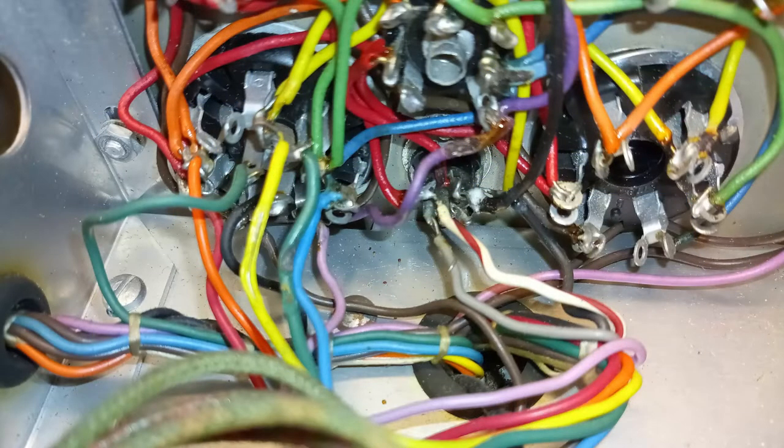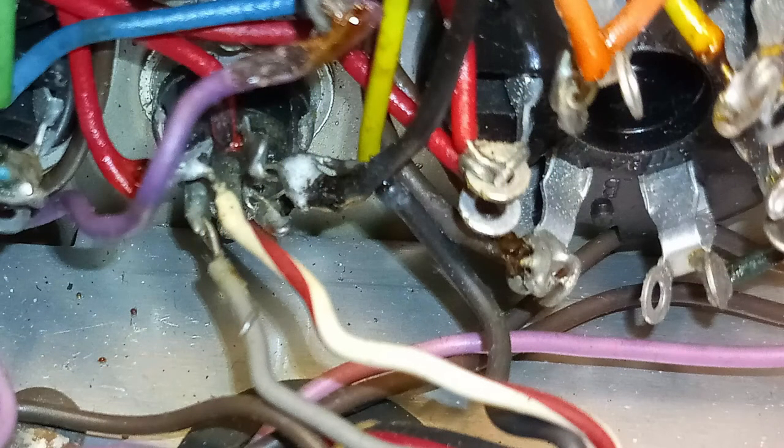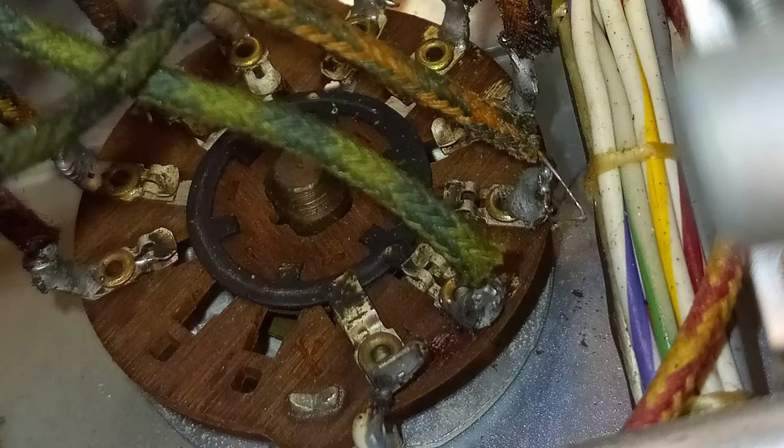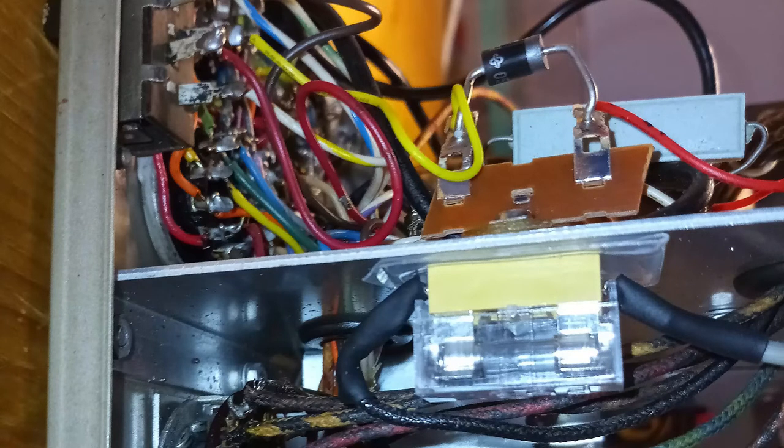Before using the tube tester, even if it is supposed to be fully functional, at least an inspection is appropriate. The soldering points should be carefully verified. Tin blobs should be removed if they are found. The wires should be insulated if necessary. In this case, also, the selenium rectifier is replaced with a silicon diode and a fuse is added.